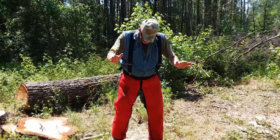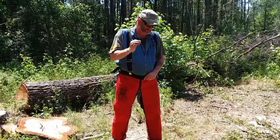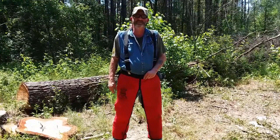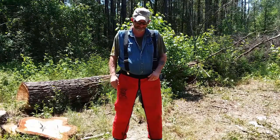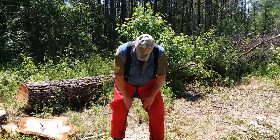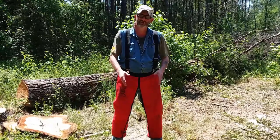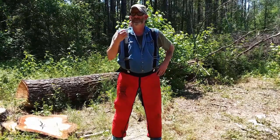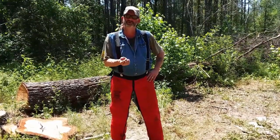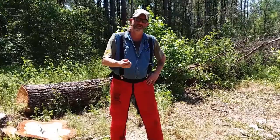And the first thing you notice, I put on a set of chainsaw chaps. Yeah, they're hot. I feel like the temperature's gone up 15 degrees around my nether regions. But going back on a rehash, you have a lot of arteries on the inside of your legs, because that is how your legs are designed. You have heavy meat and bone on the outside to protect the arteries on the inside. Being hot, being fatigued, not sufficiently hydrated, will get you hurt, will get you killed.